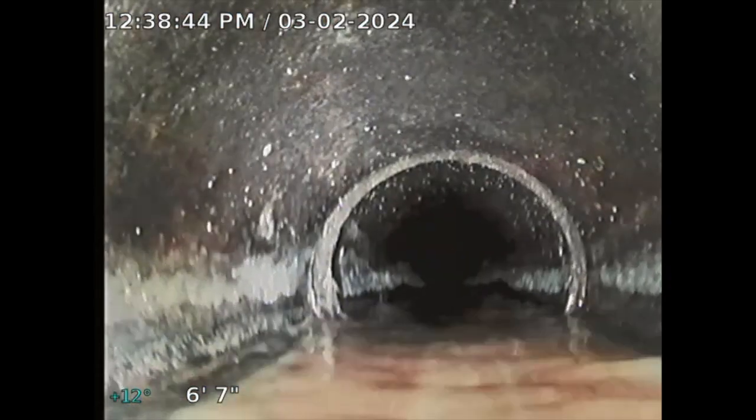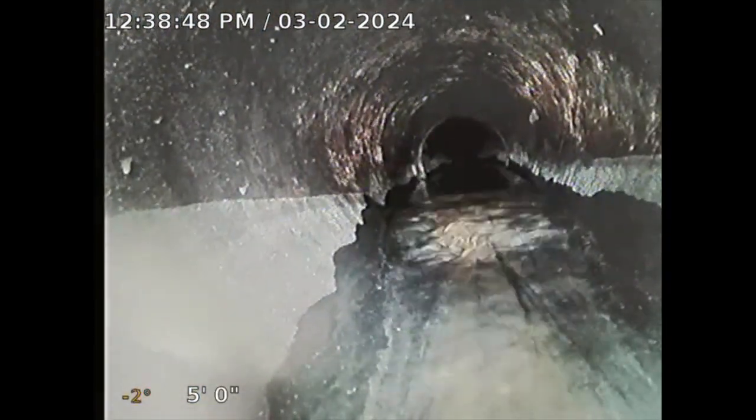The goal here is to see the inner workings of your main sewer line. At this point, this pipe is ABS. There's a little belly there — it's underwater here. I have the water turned on. A small little belly there — we'll see, just note it.